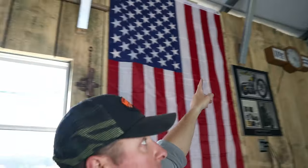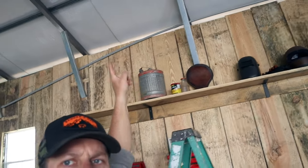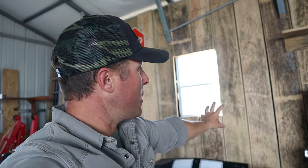I'm at the last bend on the pipe I'm about to install. This crap is always harder than it seems — I looked at it and thought run the conduit, pull the wire through, it'll be super easy, take me like an hour. Well I'm in like the third hour of this project. Another thing I didn't think about was killing the power to the shop and having no lights. So we got our power box right there, it goes straight up the wall, kicks around the back wall, goes all the way across the top. Right behind me is where I'm going to have the welding table, pretty much under this window. I'm going to go straight up, put a 90 right there, bring this wire down, and put a table-height plug mounted to the wall right there.